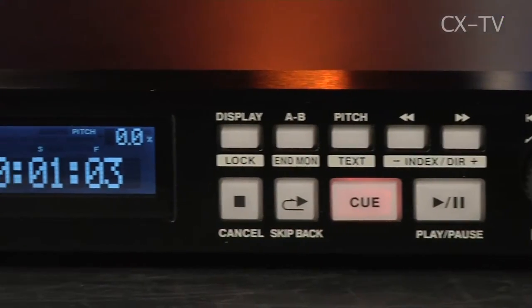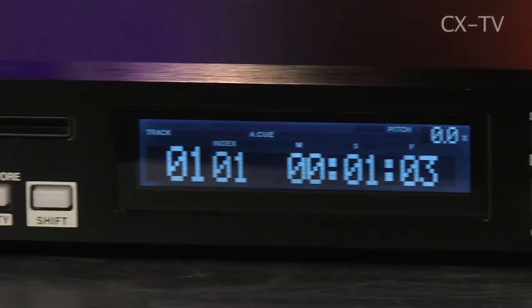To set up which directory you go to, you have to do that through the web interface, which means you need to be connected to a network. You need to know the IP address of the box, and you can only find that out from the front panel — you can't find it by sniffing on the IP interface, and you can't find it from the serial interface, which you're supposed to be able to use to control the box.